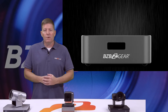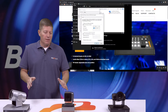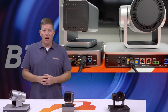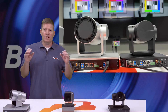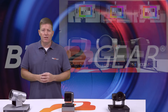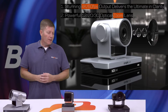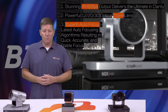These cameras have what's called web GUIs — web interfaces via a web browser. You need to network these cameras in order to access that and make video settings changes. We adjusted our cameras for this particular shot — it was relatively simple. We did it basically to the point where an average customer would adjust it: the white balance, a little bit of saturation. With the 4K camera, the image looks great. I'd love to show you the zoom on it — the autofocus is really great as well.